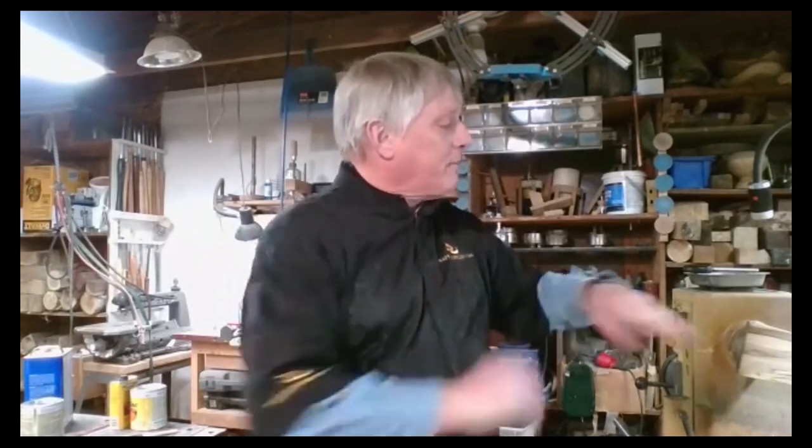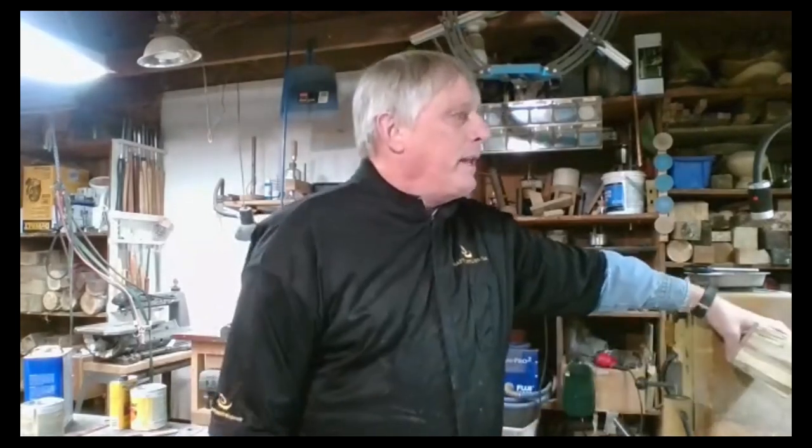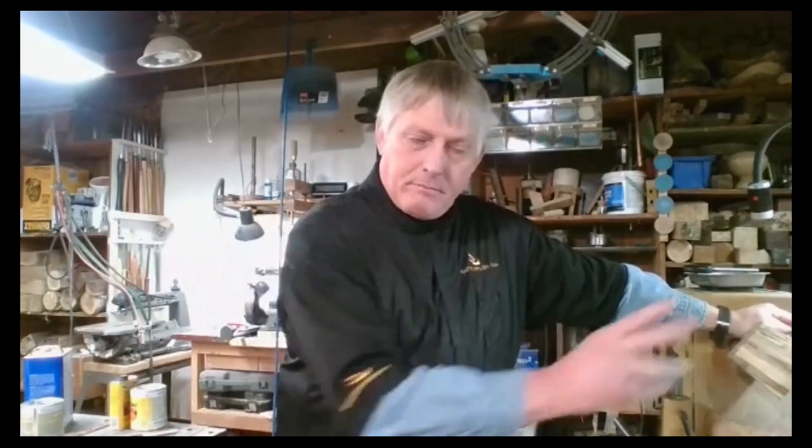With lacquer, sometimes if I really want it shiny and smooth, after I do like I just did today, I'll wait a couple of days and I'll run over it with some quadruple aught steel wool and just lightly scuff it, take off the lumps and bumps, and make sure that there is no dust in this shop, and give it one more coat, and you can really get a really nice quality finish that looks like it's been buffed to the end, an automotive style finish.